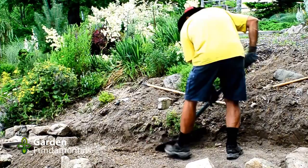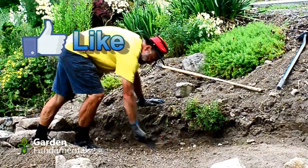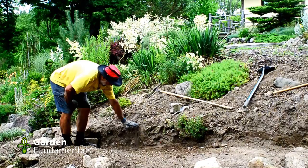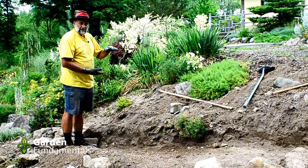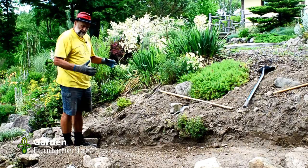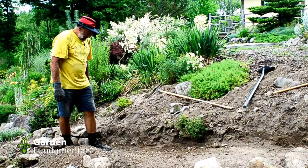You might come along with a trowel and just clean it up a little bit. You don't have to worry too much to make it level here — you'll see why in a minute. I look at the height I need and I'll end up with rocks about this high. Ideally you do it so that you have two courses of rocks, two layers. Making a wall with two is much easier than making a wall with three layers — it's much easier to keep them stable. The best option is one layer of rock, but if I had really large rocks I could do it one layer. Since I don't have those kind of rocks, I'm going to have to do two layers.